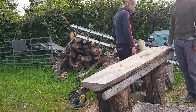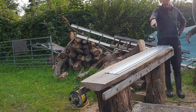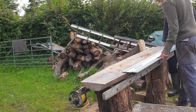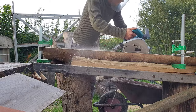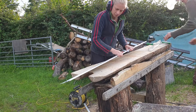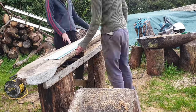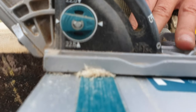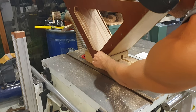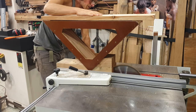By now you might be thinking: what's going to make this particularly slug-proof — isn't it just a fairly standard raised bed? Well, here's where we put the foundation for that slug-proofiness in. At the same time we're going to put a line of best fit along the waney-edged boards so we can make nice neat mitre joins. Note that we're going to have the flat face of the slab wood facing outwards. Also notice the angle we're cutting these lines of best fit at — they're 45 degrees and only about an inch, or 25 millimetres, deep.